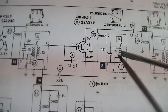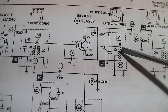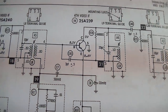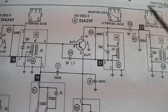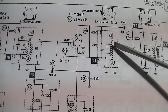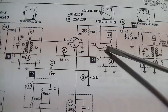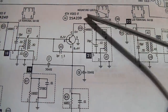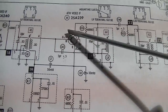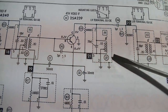But yeah, this guy is open, and unfortunately this is going to be an unobtainable part. Might be able to take it apart and fix it, but it's gonna be microsurgery. And we're going to attempt it in the next video, but that would make sense why we have the performance issues, we have the audio noise interfering with the picture, we have the rolling, because this IF transformer is open. And I don't even know how this transistor is doing anything. It must just be passing through here. There really can't be any gain without this path to ground through this inductor. So maybe that's why there's no static too.